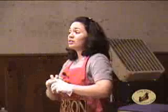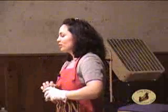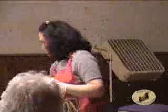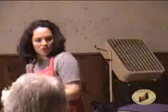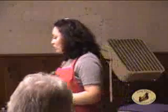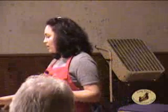After it's dissolved, you have to strain it with cheesecloth. Very important. That's why this is so much easier. So here's cheesecloth. Do you know what cheesecloth looks like? That is your final step. If you don't strain it, you will not have much shellac. And if you're going to the trouble of doing that, strain it, because you're probably working on a piece of mahogany. You've got the expense of the shellac, which starts at like $16.